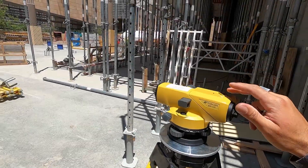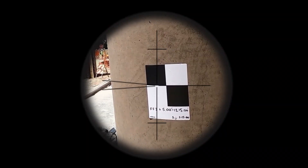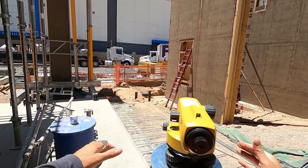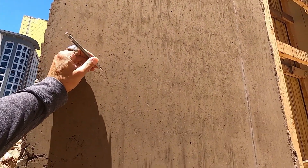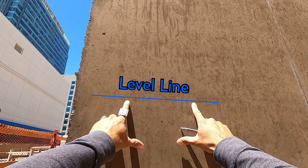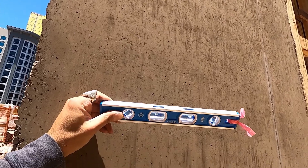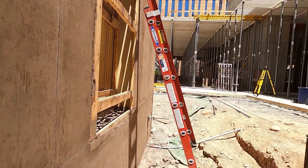Adjust the bubble again. Now I'm right on my level mark. I'm going to go ahead and set my foresight — it's going to be another vinyl target set at finish floor plus five feet, which is now the height of the instrument center at my level. I'm setting a target on this wall, which will eventually be a stairwell running up through the core of the building. When I'm out in front setting a benchmark target like this, I'll take two observations and make a crow's foot at each side. I want the distance between those two crow's feet to be longer than the width of the target I'm about to place. Then I'll strike a line between the two targets using the rigid edge of my one-foot level. I use the solid aluminum edge for scribing, and the magnetic edge only when I'm actually using it as a level.